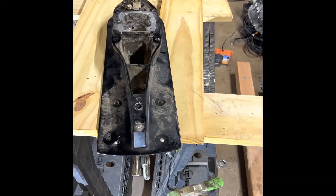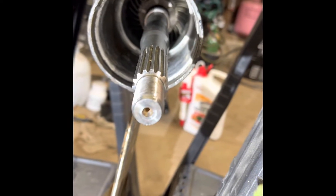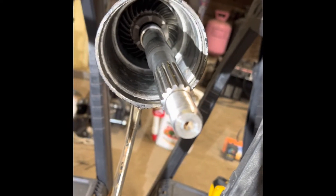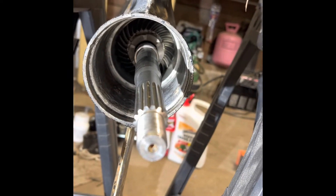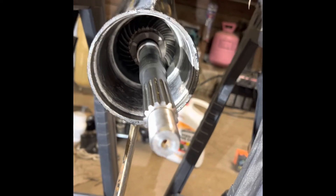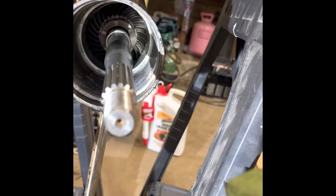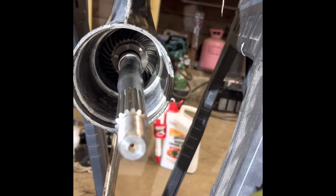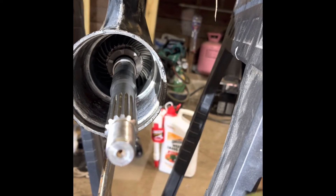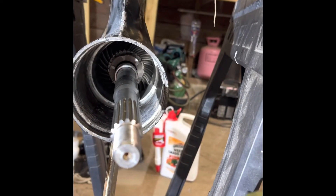This is working on Alpha 1 Gen 2. We got this in. On my first video I showed you how you put this in. If you follow those instructions, you'll see: if you get it wrong, the whole crank or the whole shaft will push forward and reverse when you twist that shift shaft up top. If you get it right, it just moves the actual clutch. When you're putting it in, if you turn the shift shaft while holding it steady, it should only move the clutch. If it tries pushing back on the shaft, it's wrong - rotate it to the left side, reset the position and try again.